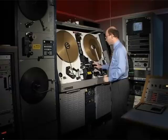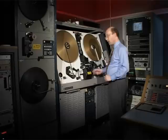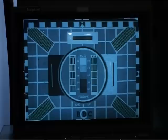Quick turn to make sure that everything is running correctly. The first thing to do is to check the gate focus — the optical focus. I do this by looking at the monitor and at the waveform monitor. On the waveform monitor, I adjust for maximum amplitude of the high frequency components on the test card. And if we look at the real picture on the monitor, we can see it for best focus.